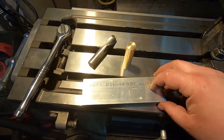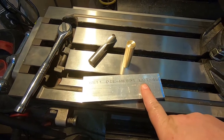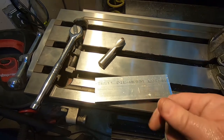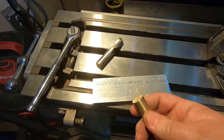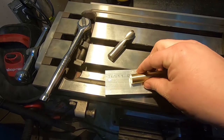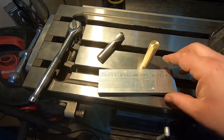I'm going to do a variant on the super glue chuck. I learned this watching Clickspring videos, but it's not a new idea by any means. If you can get a decent amount of surface area directly in contact, super glue holds on really, really well. Well enough that you sometimes have to break it free with a propane torch.